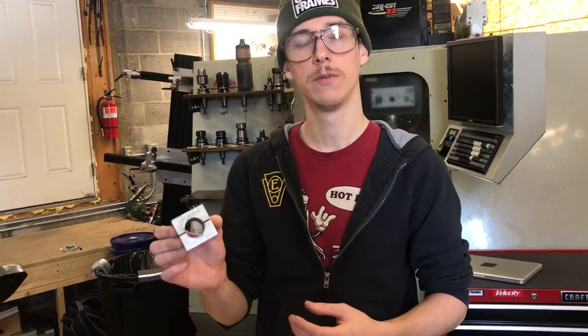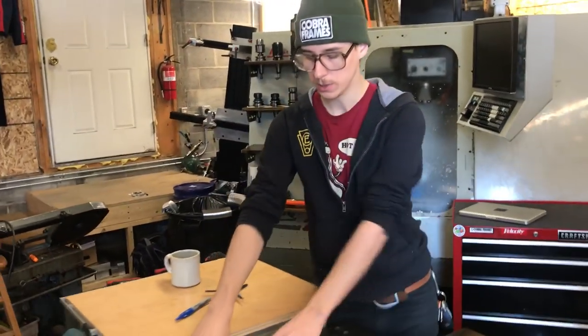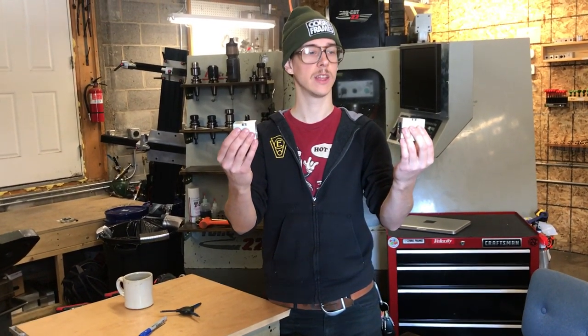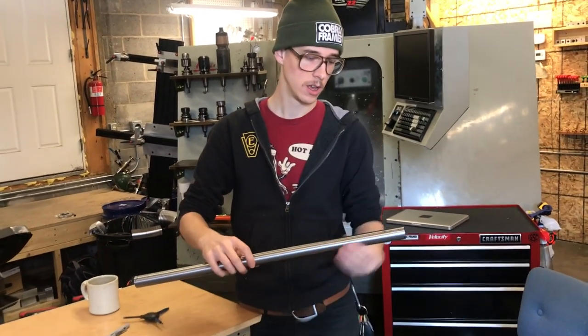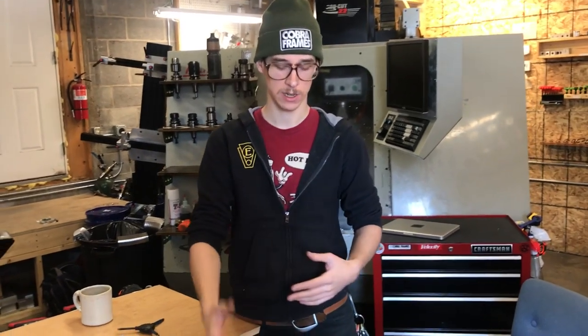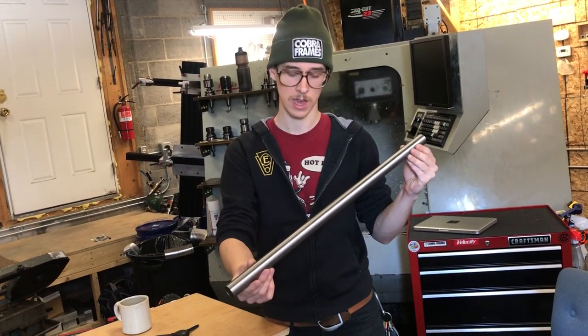If you have two of them of the same size, you can put them on a tube — this is an inch and an eighth tube and I have two of these inch and an eighth blocks. You slide them on there. The beauty of it is that when you clamp these on there, you now have something you can clamp between the parallel jaw faces of a machine vise, getting a really good hold without damaging or crimping your tubing. If your vise jaws are parallel to the axis of your machine and you've trammed in your vise, then your tube should also be parallel — the centerline of your tube parallel to the axis of the machine, which is really helpful.